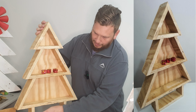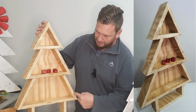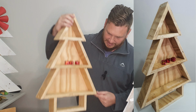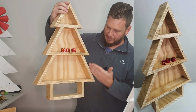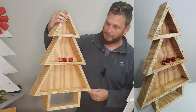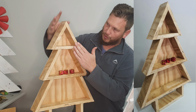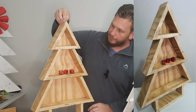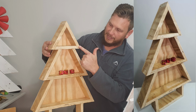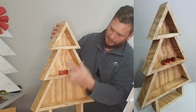Now this one has got a foot piece, three pieces of plywood, a longer one, two uprights, and then from there on you will see the design, which is very simple. It is basically a bottom piece with 60-degree angles up, and then as you go upwards, they just become smaller, all the way to the top. You can start from the top and work your way down, which is easier, just to make the small triangle that you see on top here, and then only put slightly inwards two angled.